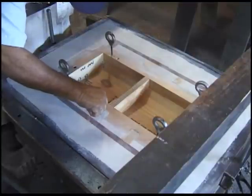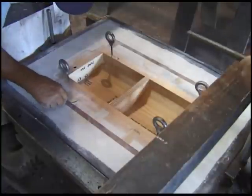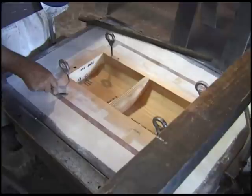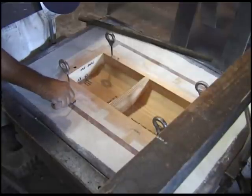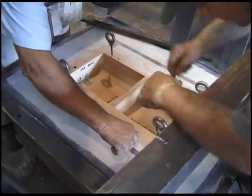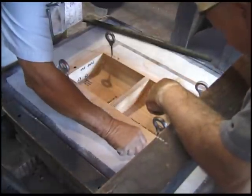Okay, so you fill from the two sides, fill the risers, and they keep the pattern full, hopefully. Yeah, they feed. Those brown things are insulated risers, and that stays molten the longest. That's why it's insulated. Right, and that keeps feeding the casting, and the casting will solidify before those ever solidify. And you'll see them shrink down when we pour it. You'll see those suckers. They'll stay liquid, and then they'll start pulling in.